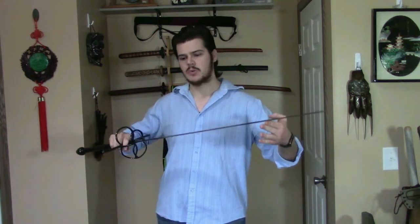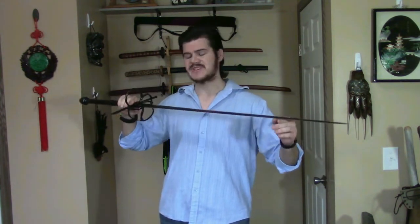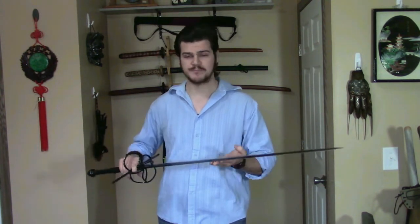And even after getting the Work Sharp, this took me over an hour to get a good working edge on it. When sharpening, I put it on high speed, which many of you probably will say, wait, that's too much heat that's going to be building up on the blade, and I did use the coarsest belt it had. What I will remind you is this is a very long blade, so the chances of overheating something like this is not that likely. In fact, I was checking constantly, and it never even felt warm.